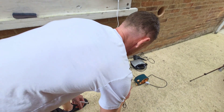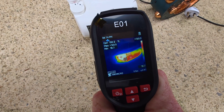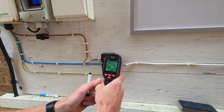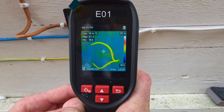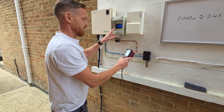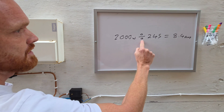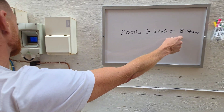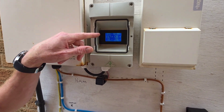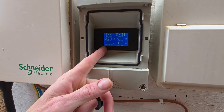We can use the thermal imaging camera to show the temperature coming out of the heater. Coming back to the cable, you can instantly see the cables are building up temperature — around 21 to 24 degrees. We're running at 8.4 amps: 2000 watts divided by 245 equals 8.4 amps, which works out exactly as expected. It's changed slightly now because the voltage fluctuates — it's 244 now. Voltage fluctuation happens in all electrical setups, though frequency stays pretty much standard at 50 hertz.